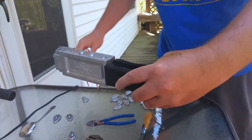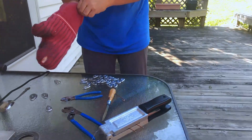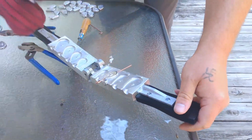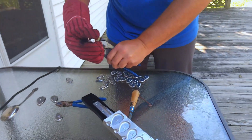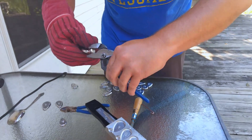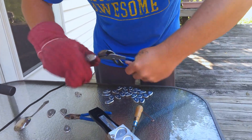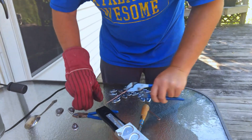It'll only take a second for that to harden up. While that's hardening up we're going to put our oven mitt on — that's what we use. Open your mold up, pop your sinker out, and break your piece of lead off right here. If you break it off it cuts really clean, so you really don't even need a file. Take your pair of pliers, kind of unscrew that a little bit, and then it'll slide right out.